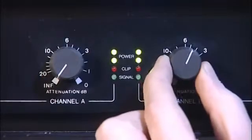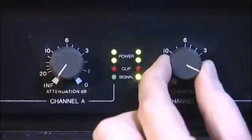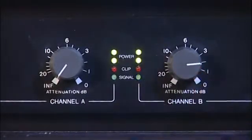Ringing out the system before the sound check is a good way to reduce the danger of feedback. You need to remember that during the process of ringing out, you can cause severe feedback which can damage loudspeakers, so be very cautious when turning up levels.